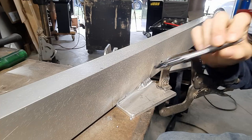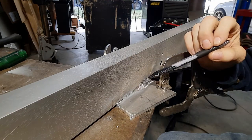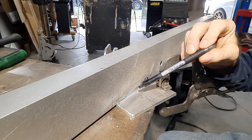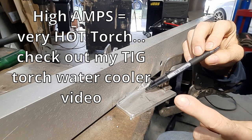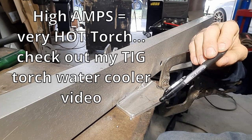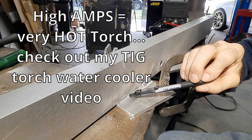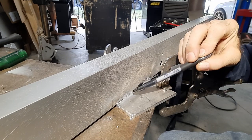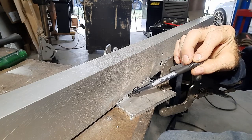The best thing I can say about this is it's a learning experience. If you look on YouTube you can find out how to weld through anodizing on aluminum tubing — the anodizing on this stuff is a little thicker than most. There are various methods, like a pulse method, and so on. Let me start by saying I am an amateur at welding at best, so taking welding tips from me is like taking tips from the captain of the Titanic on navigating icebergs. What I found is that if I run the torch across at very high amperage first — just go across and burn through the anodizing — it helps me weld at a steadier pace.